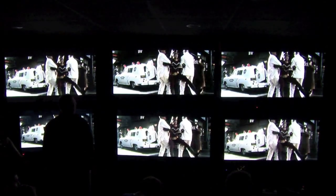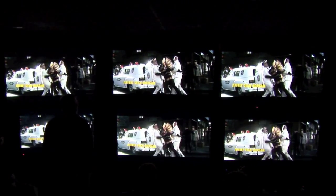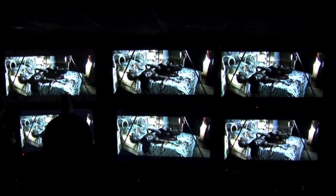When we put the checkerboard pattern up, with LCD LED technology the black level does rise. Compared to a full screen black of 0.0004, we came up to 0.002, 0.003. It came up, but not as different as it was this year. Really? Yeah, it held a lower level last year, but it didn't stay at 0.0004 last year either.